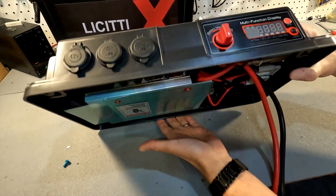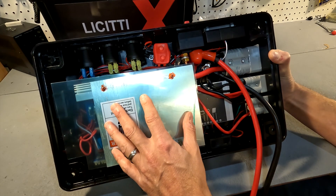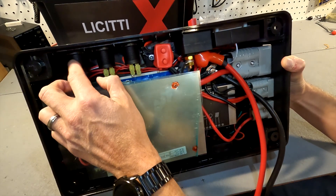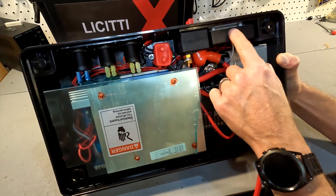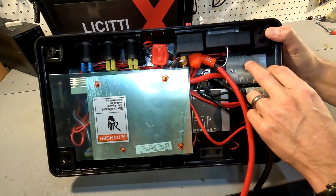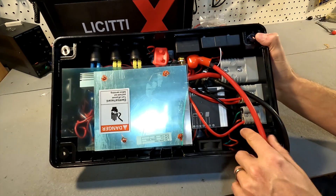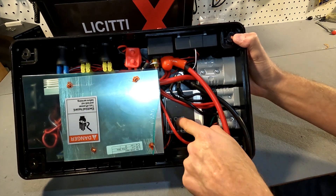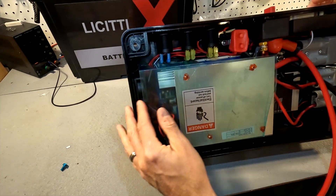Here is the lid of the battery box and what's on the bottom of it. Right here is the main circuitry for the AC inverter, which is a 1000 watt inverter. You also have your DC 12 volt plugs, the USBs, and a 12 volt cigarette lighter style. Here is the on/off switch, the circuitry for the display and mode buttons, and the Anderson connectors — a big 175 amp connector and 50 amp connectors. Down here there's a red and green wire going to the solar MPPT charge controller, and over here is the circuitry for the outlet and fan.